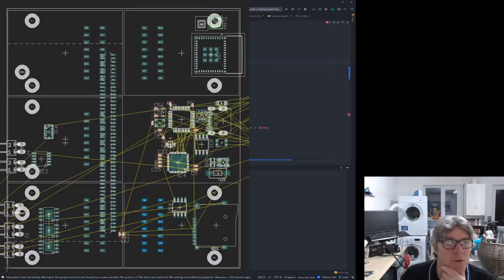And in this particular one, the automation one, it'd probably be an ICE40, something like an UP5K perhaps, for the FPGA side of things, and then probably a low-powered STM32, a modest microcontroller. That would be able to do the programming of the FPGA. It'd also be able to run Rust and things as well. There'd be some flash, a USB connector, a DFU button, a few LEDs, so fairly basic. Most of the goodies come as expansions that you plug in to do your particular thing for a particular project.